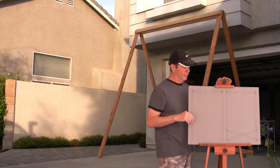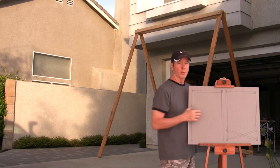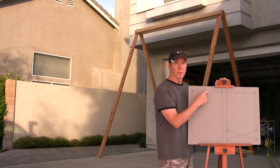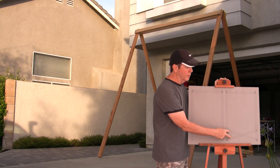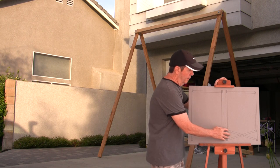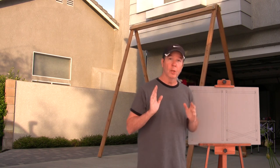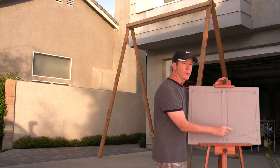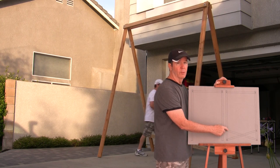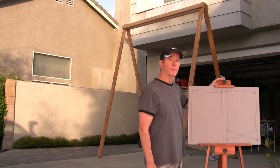So what you have is your 10-foot 2x4s as your vertical supports, your 8-foot 2x4s as your horizontal members to support the pulley, and the two 8-foot 2x4s down at the bottom for your cross members. Now, the diagonals are a little tricky because you want to mount them up high enough to give everything rigidity, but low enough so your truck frame can pass over the top of them when you back up. So you're going to want to pull your tires right up to this bracing when you're mounting the tent, because that'll put the apex of the tower about 2 feet over your truck.